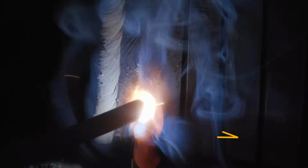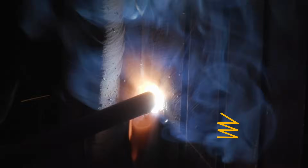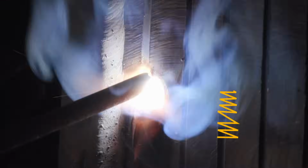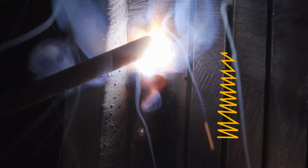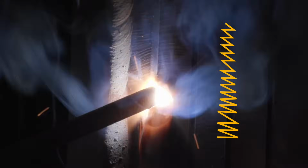What that's gonna do, that's gonna help you keep your zigzag, your weaves very tight. All right. So you're gonna remember, you're gonna go across, and then you're gonna open up, pause, 1, 2, across, 1, 2, all the way through. So make sure you're always pausing, always pausing.